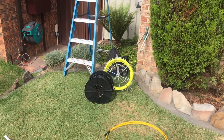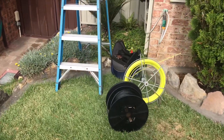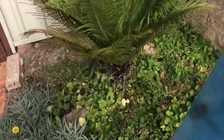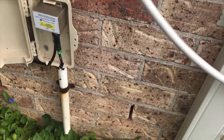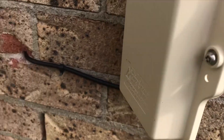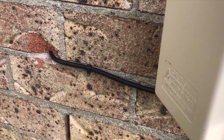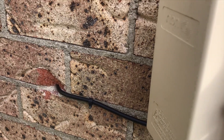I'm at a job today in the Southern Shire, basically doing another relocation of an HFC connection. As you can see here, it's only 1.8 meters from this box — they've just put a little bit of cable in, drilled through the wall, and gone into his bedroom where he doesn't want it. He wants it in his office at the other end of the house.